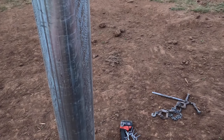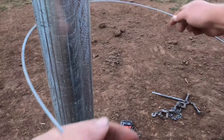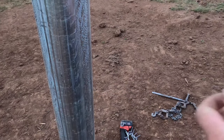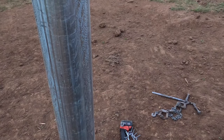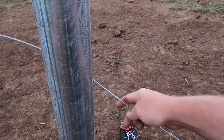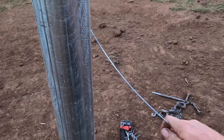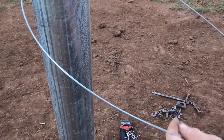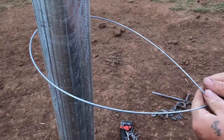This is going to be tying a termination knot, which is what we use on the net wire or any of the smooth wire. The line is going to go on the outside of the post here, so you're going to wrap it around the post. Now if it's a wood post you want to have it pretty close to where you're going to be, but with a metal post it's really easy to slide in.